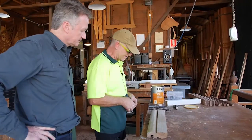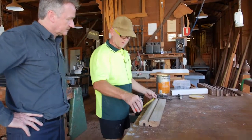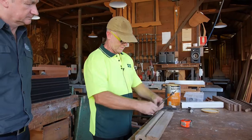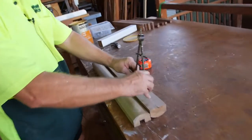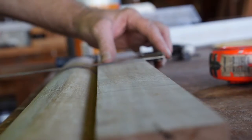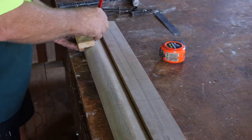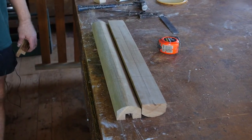And with the slat design, each panel is individually plotted out, and I'm going to do the same here with a dowel design. We do a measurement and then a calculation. We can mark off each plotting point, and each panel is then made individually as per this calculation. They are then bored and assembled.